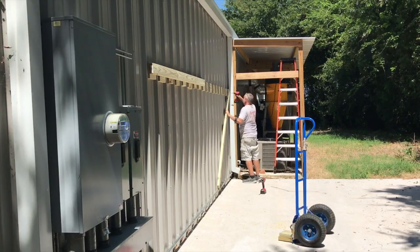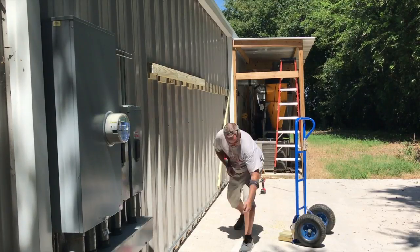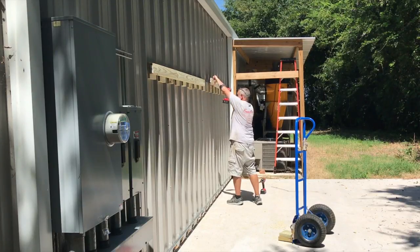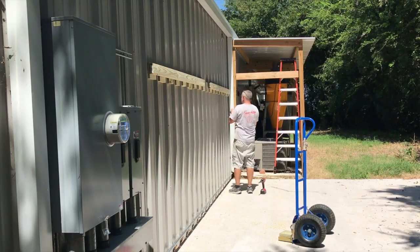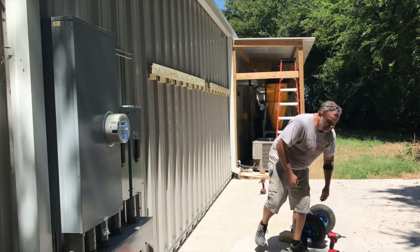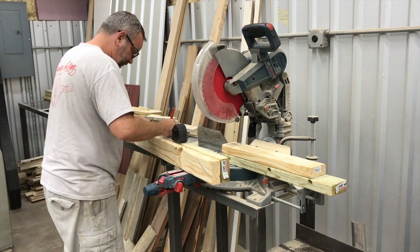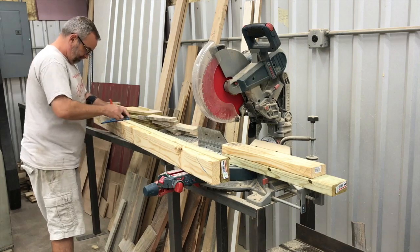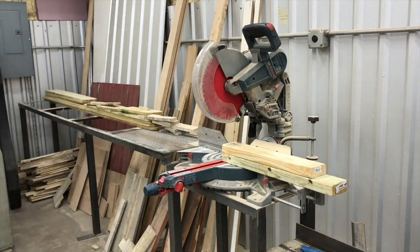And then once I get my walls up, I'm coming back with a 6-inch lag bolt style sheet metal screw to go through all those blocks into the purlin. So there's a lot of attachment points there, and then of course it'll be nailed and lag bolted into the concrete down below as well. This is similar to how I did the lean-to that the equipment is under, and we've had a lot of high winds, 40-50 mile-an-hour winds, and there's been no issues with that. So I think it'll be fine for this.